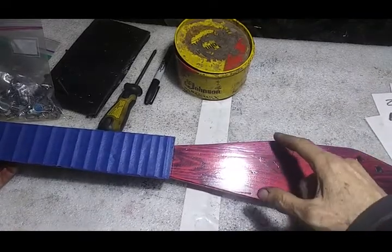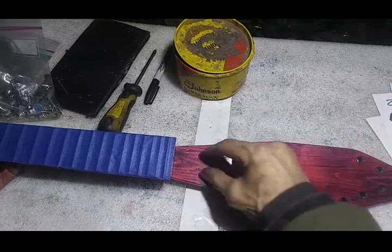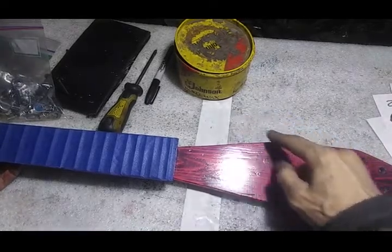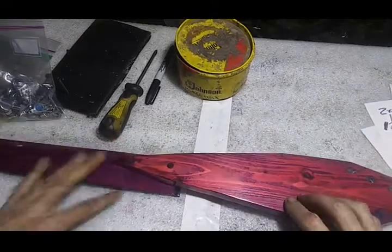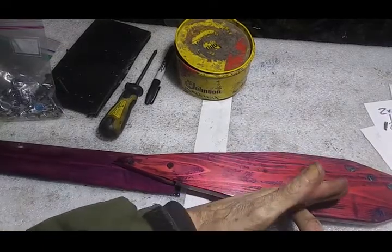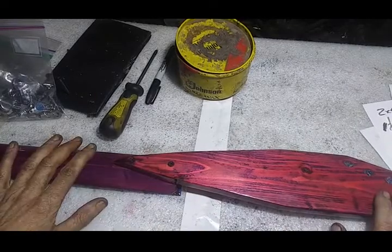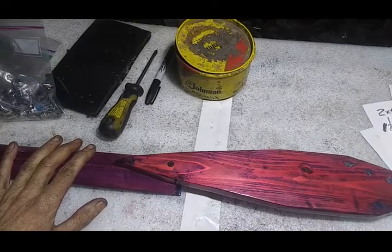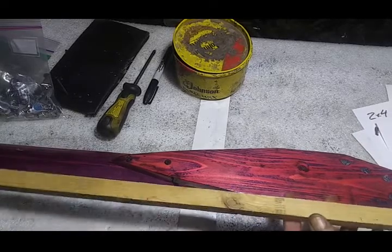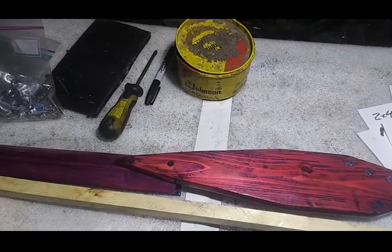And it looks like the bar should start coming out from the body about where the body changes from going straight to starting to slope down towards the center. So right about here is where the leg bar should come out. So that would put it back here somewhere. The bottom edge of the bar will be right here and will be at a 25 degree angle. And looks like there's going to be plenty of territory to screw everything down, so that doesn't look to be a major issue. Let me fish up the bar blank. I'll be back. So here's the bar blank. It looks to be about a 2 foot section, and it's maybe 15 mil square, something like that.